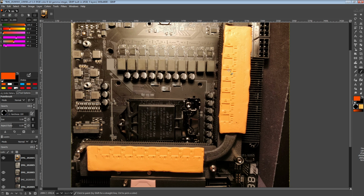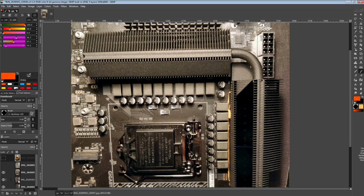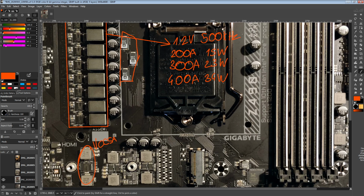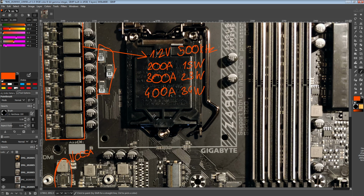Yeah, so the heat sinks on this board are completely ridiculous. If you for some reason did want to have a 500 watt CPU, this board would totally handle that. It's just completely impractical. You'd literally need to be probably running the CPU at like minus 50, maybe lower, in order to hit this kind of current draw. And even 400 amps would probably degrade your CPU pretty quick. You might want to be aiming at minus 100 instead of minus 50.